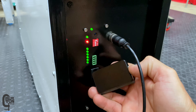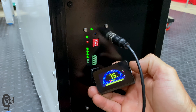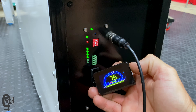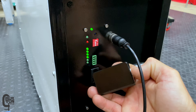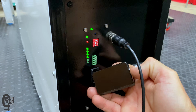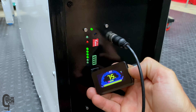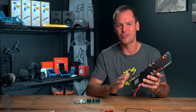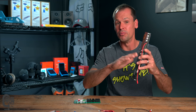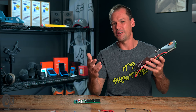When it comes to screens, this BMS is compatible with a 2.5 inch display screen that works with the other style of JKBMS, which I previously reviewed — I'll leave a link in the description. It is also compatible with the larger 4.3 inch LCD touchscreen. The smaller screen has a gray on-off button on the side; long pressing it turns the BMS on or off, and a quick press wakes or sleeps the screen. On the smaller screen it shows you charge or discharge rate, remaining battery percentage, a bar level indicator, state of charge, and total battery pack voltage. If you want more information, you'll need to purchase the 4.3 inch LCD touchscreen.